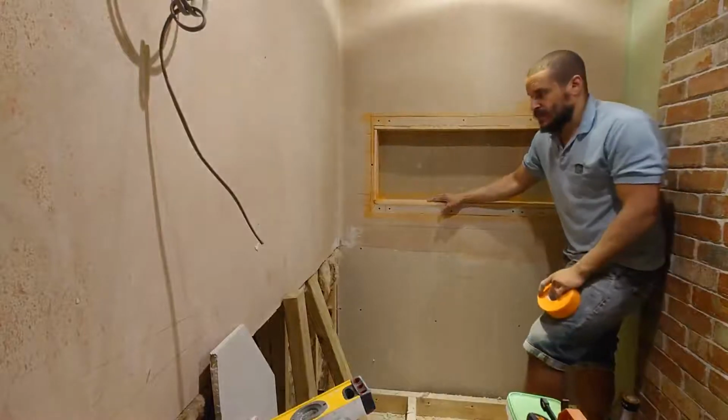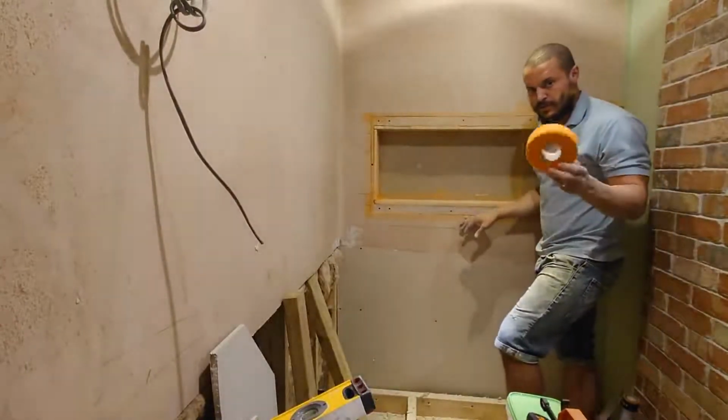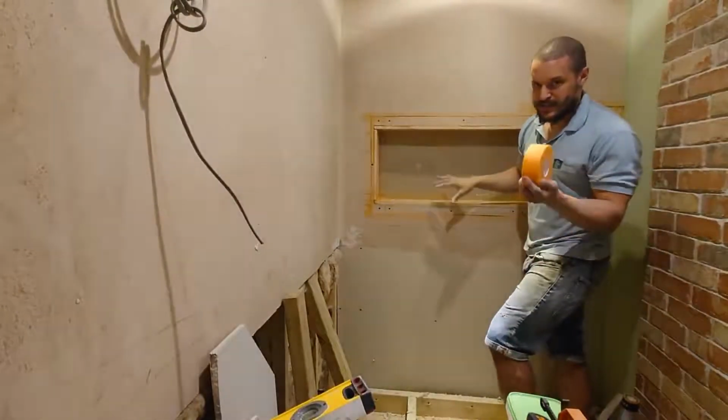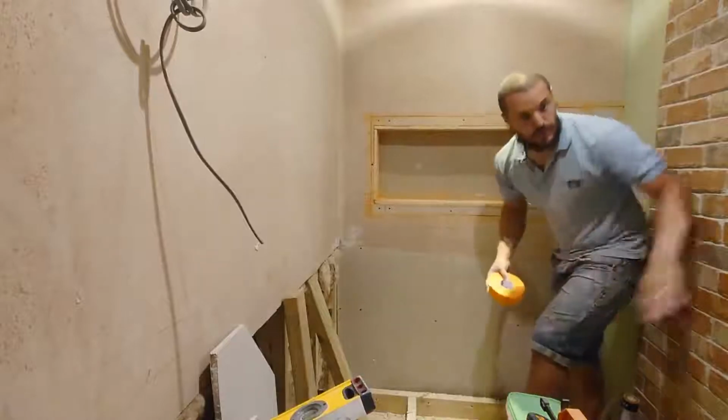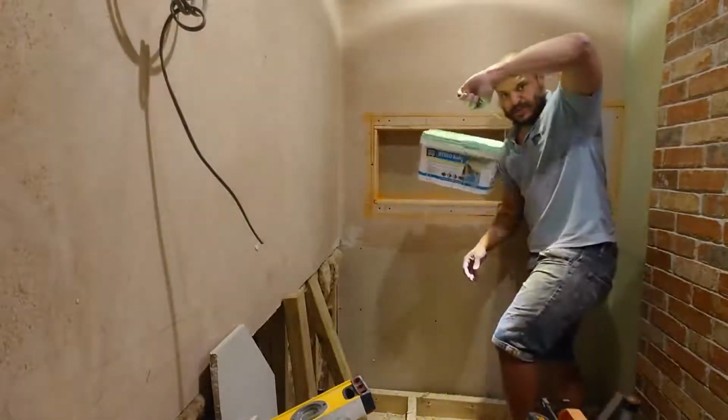They're not waterproof ones though, they're not damp proof plasterboard, but that's okay, because now what I'm going to do, I've covered this all up in this reinforcement tape you'd use for plastering normally. The idea being this covers up the crack, so should flex a little bit as well. And then now, if you recall, on the chimney stack over here, I used a product called Hydroban.